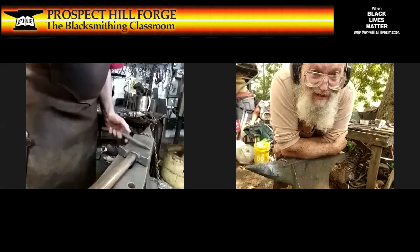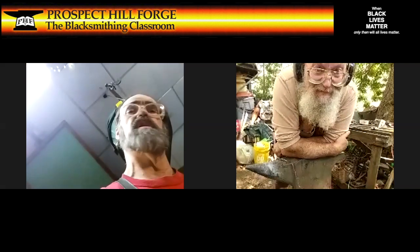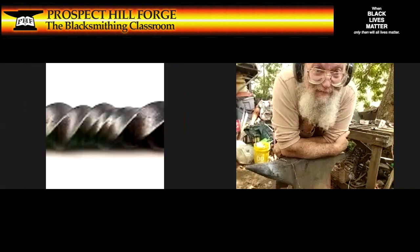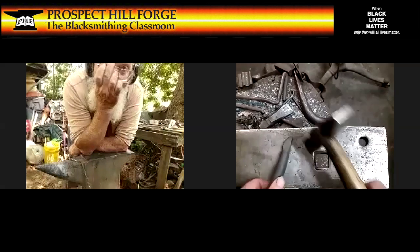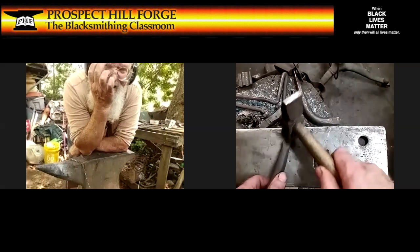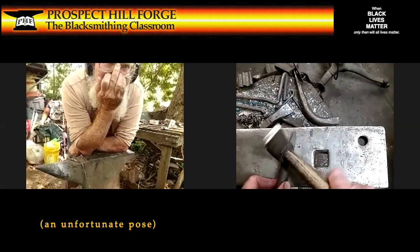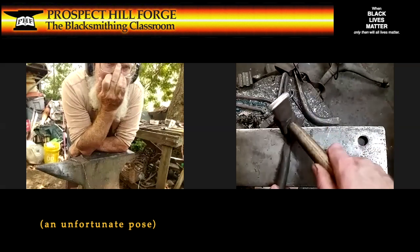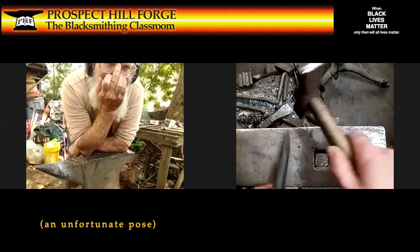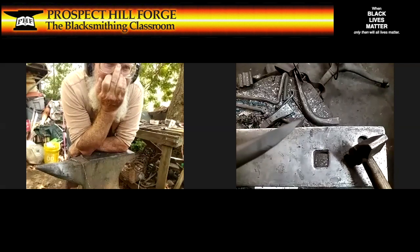And actually, you know what? I can show you something better if I do it first person. So I'm gonna hammer in like this. I'll get a point. Note, these hammer blows do not work on steel. But if I hit clay like I hit steel, that's bad too. So I've got a square cross section.